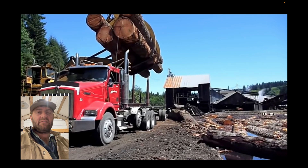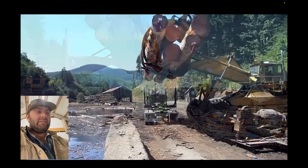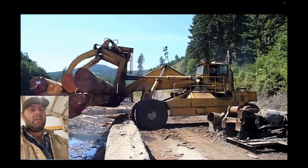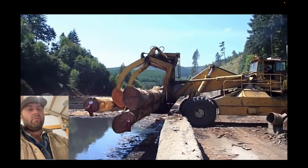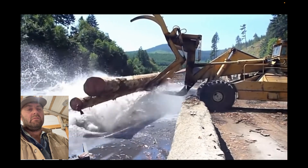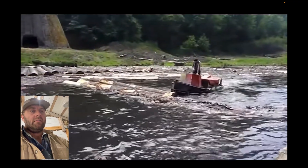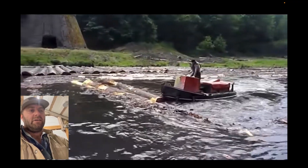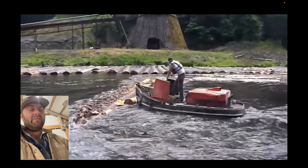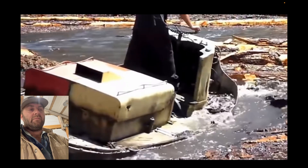This video is going to show you one of the fastest sawmill operations I've ever seen. Starting off, you see this guy is dumping logs into the water. The reason they do that is to keep the logs from cracking — they want to keep them wet as long as they can until they get to the sawmill. This guy's got a bumper boat and he's going to push this log to a lift conveyor which will take it up to a debarker.